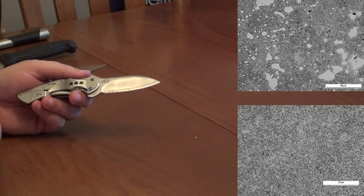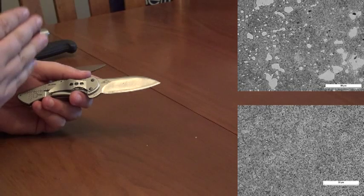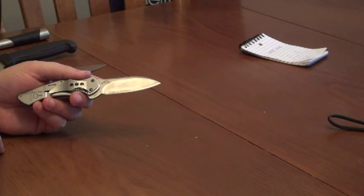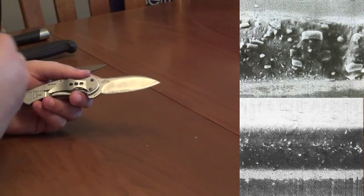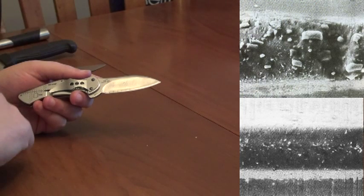It's a razor blade steel. It's made to achieve the highest hardness you can get in a stainless steel while still having a high level of corrosion resistance. That's due to the balance of carbon and chromium in the mix. You can increase those properties with other alloying elements, but for a basic carbon-chromium steel, this is essentially your optimum mix. It can get up to 62 to 63 Rockwell on the edge, easily obtain 95% martensite formation with very small amounts of retained austenite, very tiny primary carbides less than a micron, and no aggregate or clustering of the carbides to make it coarse.